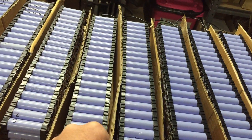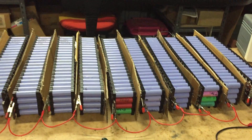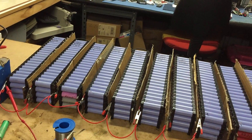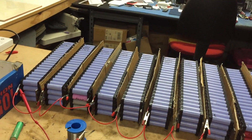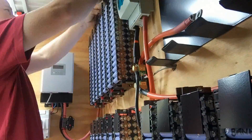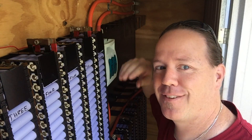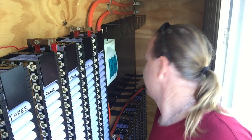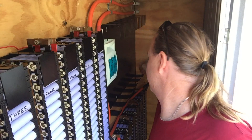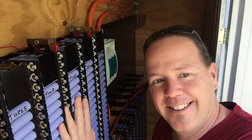As you can see this time I've put cardboard in between each one, so I didn't die from smoke inhalation. I've also gone through and done another manual check on every single connection and there were none broken this time, which is good — but then again, I was handling them much more carefully. So the worst part about this reinstall is the 14th pack, right down here in this corner — there's not much room. Bit of poor design on my behalf. This bolt here, which is the negative terminal, has to be done up right here, and it's the single biggest design flaw of this whole idea. Let's get the rest of this in and get it back online again.